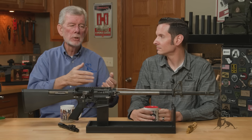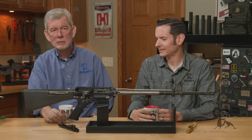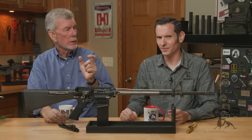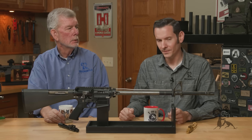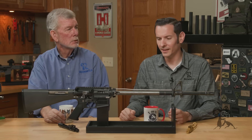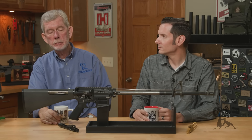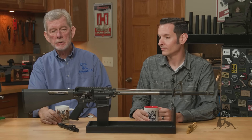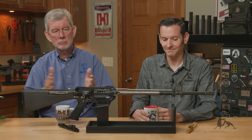There's a little more leeway for those guys — they will allow a longer chamber sometimes. We have that special headspace gauge that is longer than a no-go, and it still says you're okay. But you don't want to shoot it — it's hard on your brass, and your gun's not going to be performing as good as it could be. Those longer field gauges are just saying your gun is safe to operate, not that it's going to operate well. Some of you with class 3 ARs, this might be an issue more than anybody else. The rest of us shooting semi-auto — with the price of ammo these days — we're not going to wear in the headspace that much, not anytime soon.